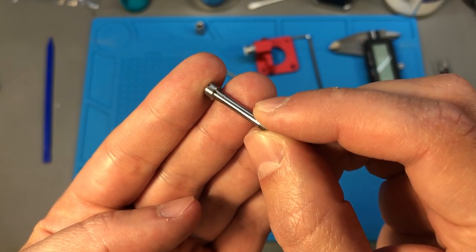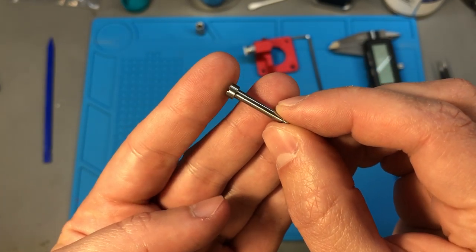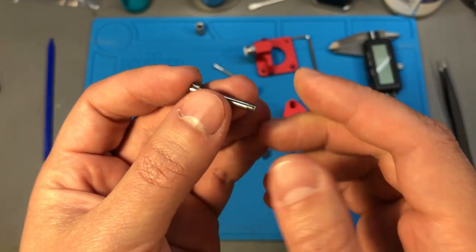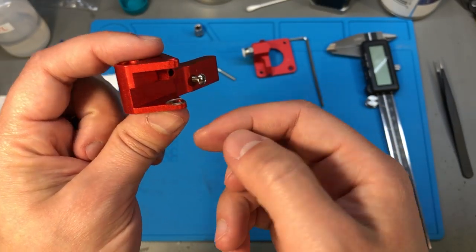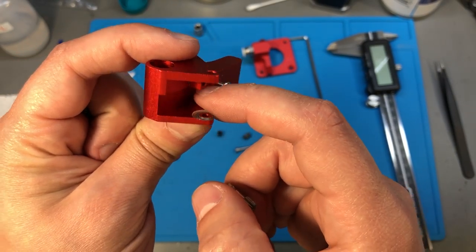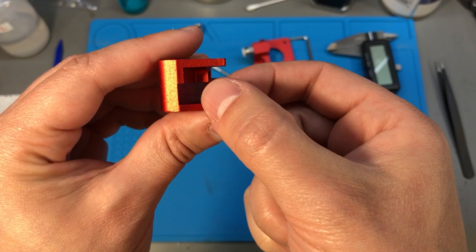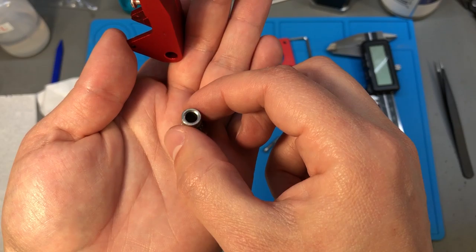Through the magic of editing, I contacted someone with a machining shop locally and he was able to manufacture this special pin according to my drawing. Interestingly, I found out he is a viewer of the channel, so we had a little chat. He told me that if I still have problems I should return and let him grind away some of the bottom surface in the aluminium to fit a steel washer sitting at the bottom of the cogwheel, which would remove the vertical play and possibly provide a better interface for the steel cog to run on.